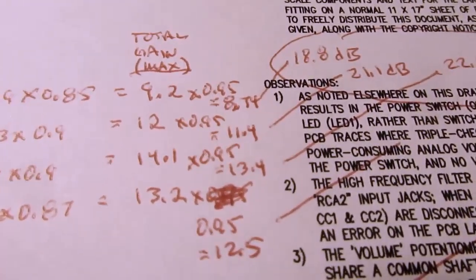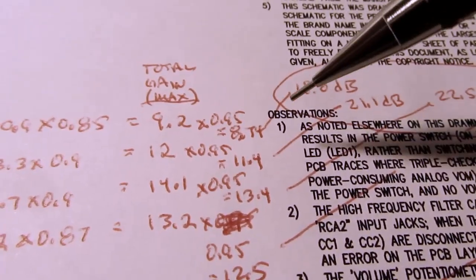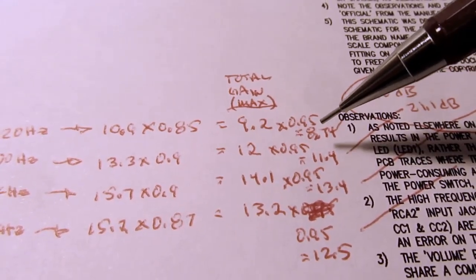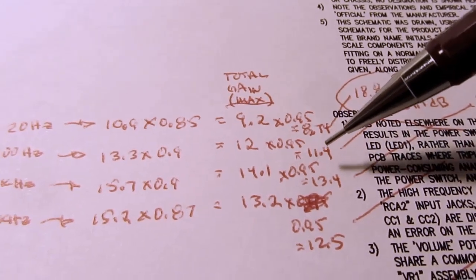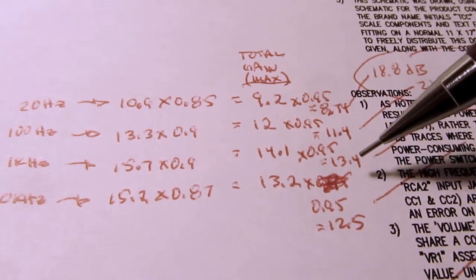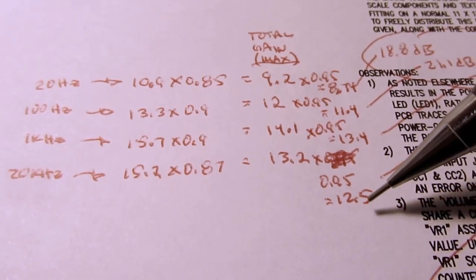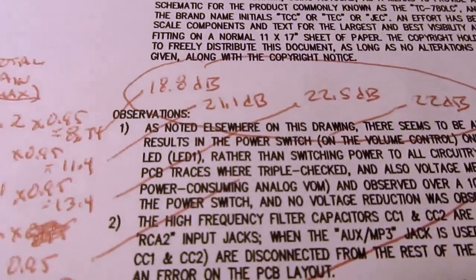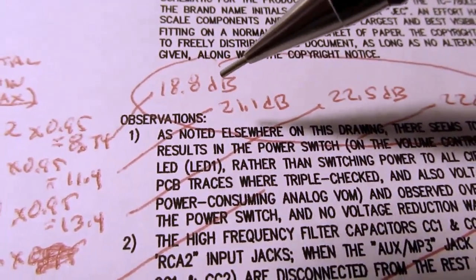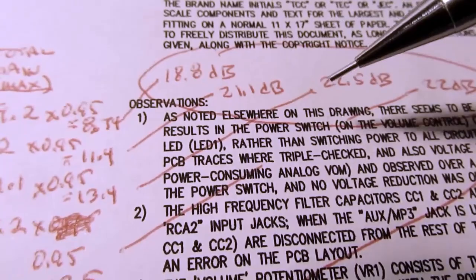you end up with, and again, this is all assuming that the volume knob is turned all the way up. At 20 hertz, you have a gain of 8.74, at 100 hertz 11.4, at 1 kilohertz 13.4, and then it drops a little bit at 20 kilohertz 12.5. If you convert those into dB, at 20 hertz it's an 18.8 dB gain, at 100 hertz it's 21.1 dB,